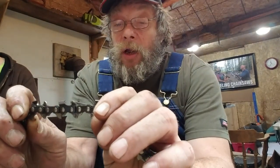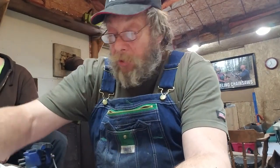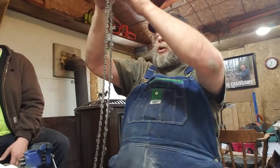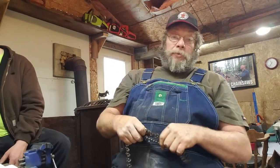Now, because I like my rakers flat, it's obvious I don't use a depth gauge. Yeah, you guys will argue the point. Oh, you've got to do this, you've got to do that. I ain't got to do nothing. Run a saw with me. Not just one chain, run it for many days. You won't catch my saw not cutting right. I'll promise that.